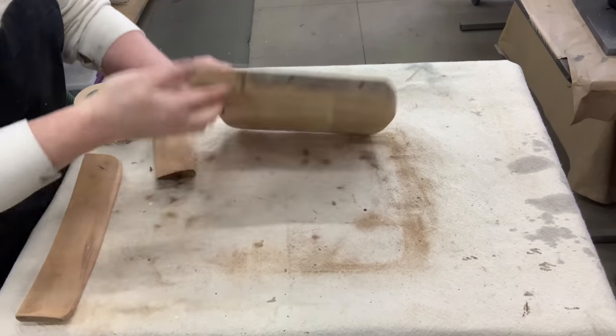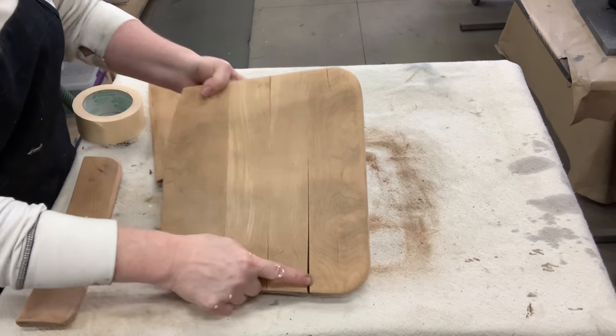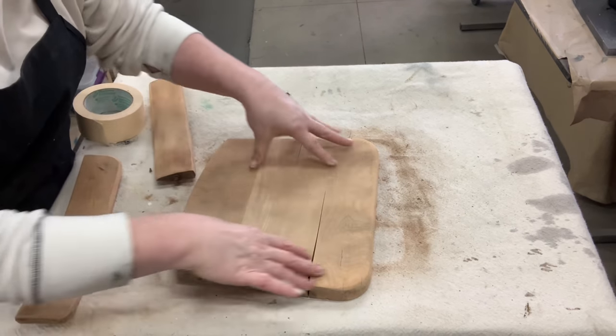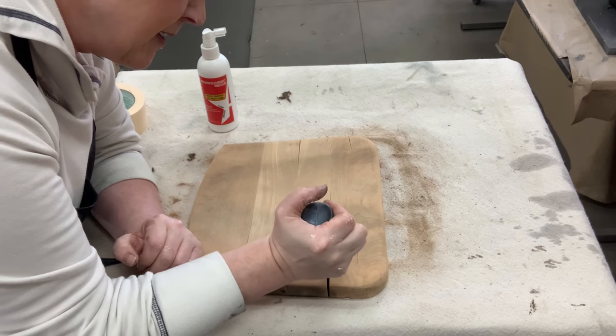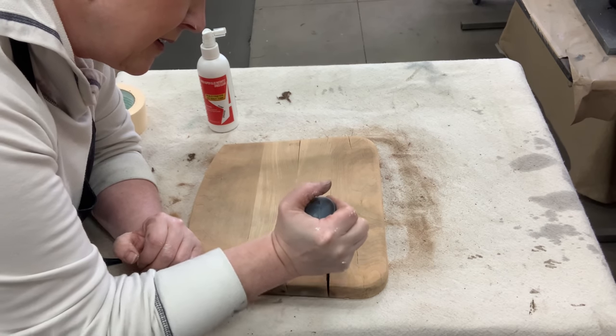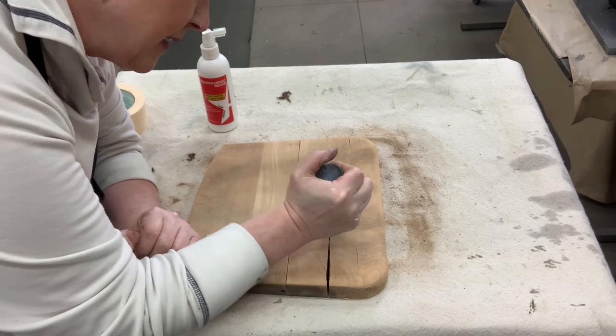So now, because of the age of the seat and maybe being in the weather, wood dries and it just shrinks and splits. It's actually not the wood pieces, the slats themselves, but where the pieces that were at one time glued together are no longer glued together, and it's not something tight bond glue would do anything for. You're not going to pull those together. So I absolutely love, and you guys have heard me 100 times recommend, the Starbond products. Now this is the dark black one, so I'm going to treat this like an epoxy.